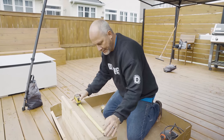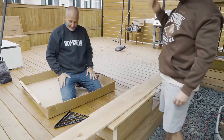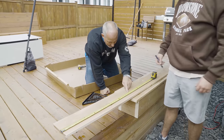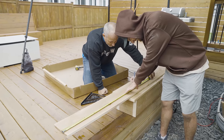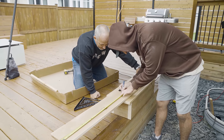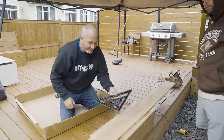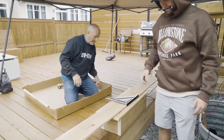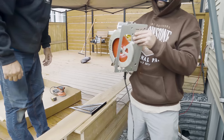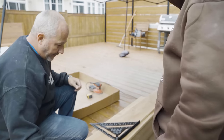I've got to face this with my 1x8 cedar. It's a perfect 28 — nicely done, Matt. Good old-fashioned math: the material is three-quarter inch, so consider it 1 inch. You want to cut it at 30, but since we have plenty, let's cut it at 32. When you cut this thing, it's backwards because you want to use this as your cutting guide. You've got to put a 45 on that saw — turn the table to 45. That's your cut.